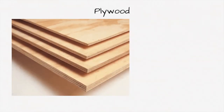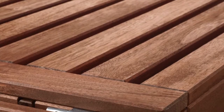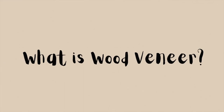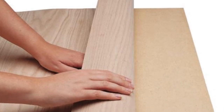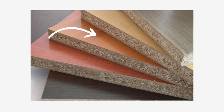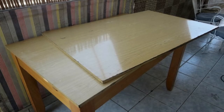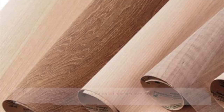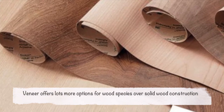Plywood is made from thin layers of wood that are pressed together, layered so the grains are at right angles to each other, which reinforces the strength. Plywood can be stained to match the rest of the piece, or sometimes a veneer is glued to the outside. Wood veneer is a thin layer of real wood glued on top of one of these surfaces. Another material you may run into is laminate — made by pressing together multiple layers of plastic resins and flat paper, printed to give a wood grain appearance with a shiny finish. A veneer is a thin layer of real wood; laminate is not wood at all.